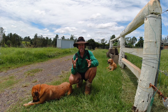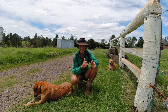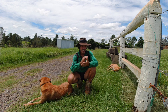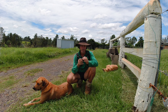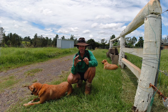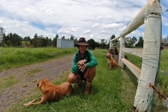Also, when vegetation is against the fence it's chewing voltage and actually draining the battery. If it's left there long-term and you have days with not much sun, it's going to drain all that power out. And if you've got it hooked up to mains power, vegetation zapping that line means you are actually using power. It doesn't use much power if there's no vegetation touching — it's just maintaining voltage. It's only when you complete the circuit — when an animal, human, or vegetation touches it — that you start using current and therefore power.